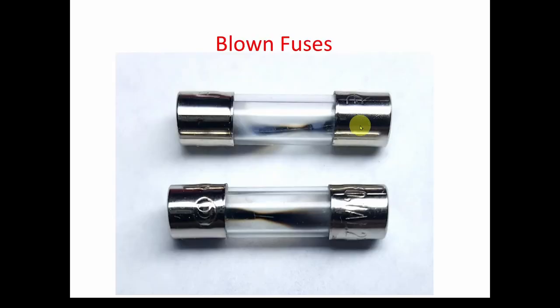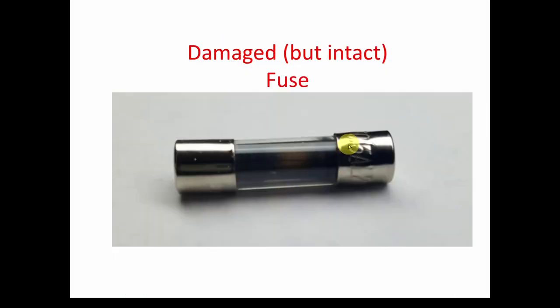For bench equipment with glass-tube fuses, you can look inside and see a black, melted wire and say the fuse is blown — good visual indication. But that's not always true. Here is a half-amp fuse I applied one amp to for over 30 seconds and it never blew — twice its rated current, and it never blew. It started melting and put out a lot of smoke inside, but it was still working. That's one important characteristic of fuses.